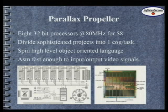All of this stuff runs on a Parallax propeller. Parallax is a company that's been around for a long time — they've built basic stamps and bo-bots used heavily in education and by hobbyists and roboticists. They've recently put out a very interesting processor that's ideal for building hobby projects, but also used in industry for relatively sophisticated projects. It's an eight-core processor — eight processors running on one chip. They share one global memory, they're 32-bit, they run at 80 megahertz, and the whole thing costs $8 in quantity one. Having multiple cogs lets you split complicated items into their own separately running processor, making it easy to share data and debug projects one at a time.